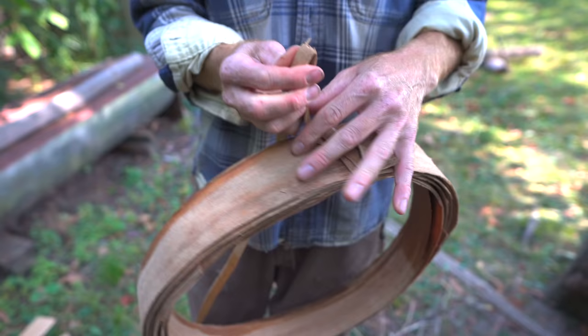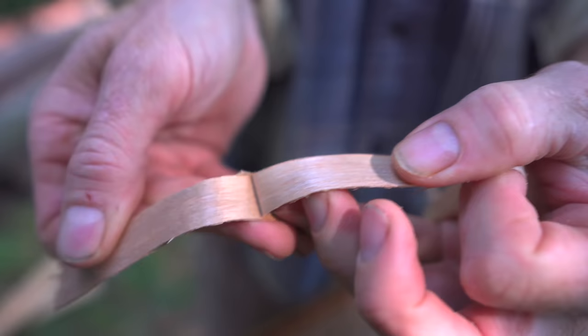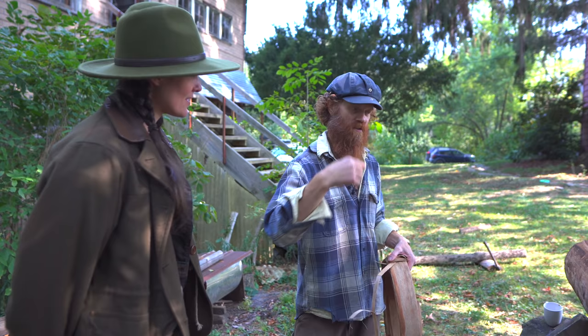Another thing I could show you right now is that this wood can be split within itself, which is really beautiful. It's satiny on the inside. Wow, that's nice. And if you're careful, you can do whole pieces all the way down like this. That's like the stuff that you finish on the edge of your countertop, like that little lip on the countertop. Sure. Basically what we're doing is veneering. Just whole annual ring veneering, not like a turned piece that cuts through the years. This is a real strong veneer.